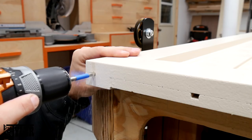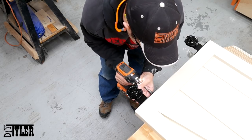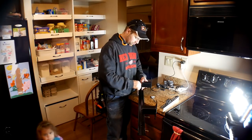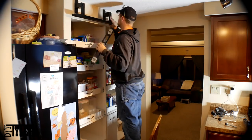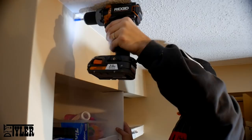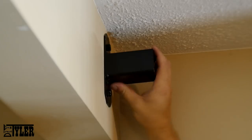The hardware for these bypass barn doors is hung from the top of the doors themselves, drilled and lag bolted into place. To hang the bypass rail I first bolted on the bracket assembly to get good alignment, then held it up into place and marked where I needed to drill holes for the lag bolts into the header. The brackets themselves are lag bolted right into the header of the closet using two inch quarter inch lag bolts.